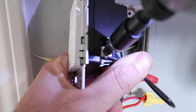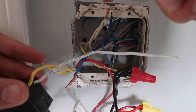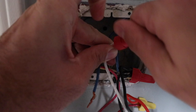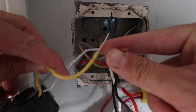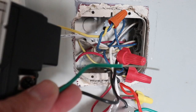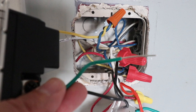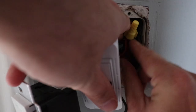Now we'll install the hot wire on the back of the Lutron fan controller. We've got the hot wire connected. Now we're going to take the white neutral wire on the fan controller and connect it to the neutral wires in the switch box. We're also going to make sure that we reconnect the neutral wire that was attached to the existing light switch that controls the dimmer side of the fan. Now all we have left is the yellow load wire on the fan control, and we need to connect that to the load wire in the existing junction box. If you have plastic switch boxes, typically you're going to have a separate ground wire. Here we've got a conduit switch box so the conduit is the ground. However, if you do have a ground wire, you're going to want to make sure that you connect the ground wire on the switch.